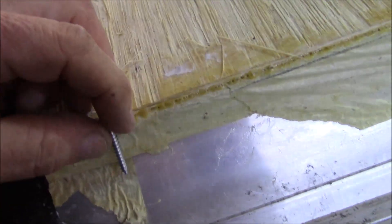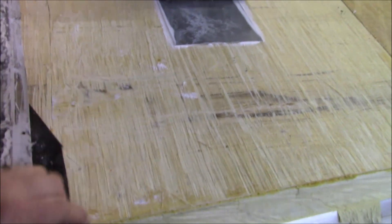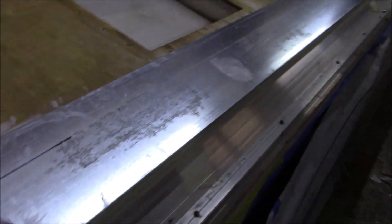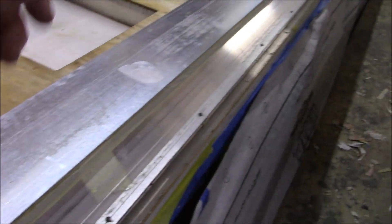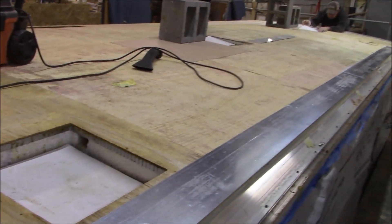There's just foam under that eighth-inch, so screws go straight through into nothing. We also have to redo the awning assembly because it's not seated right. There's another piece of steel that runs all the way down — we're going to put mounts in there, screw into that, and the other one will come over and lap on top. Then we'll put our stud mounts in with boots and she's good to go all the way down. We're getting prepped and ready for the next layer of decking.